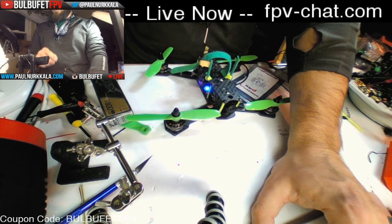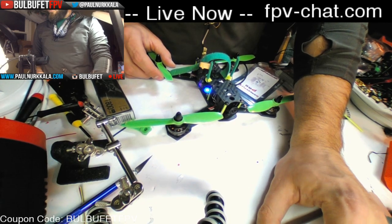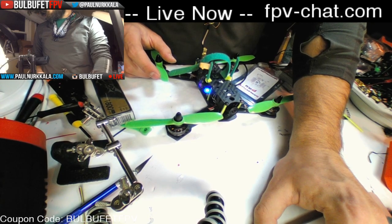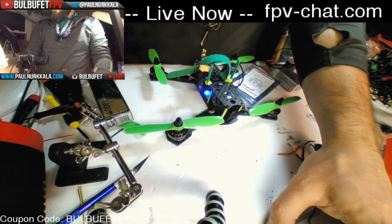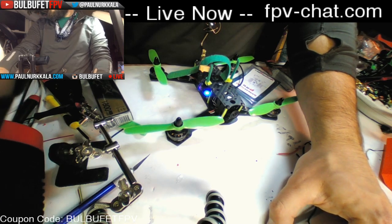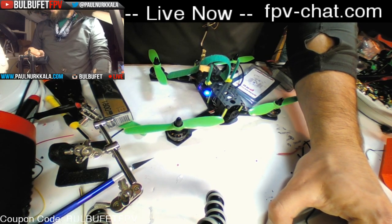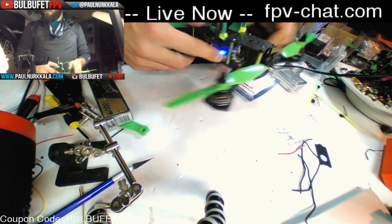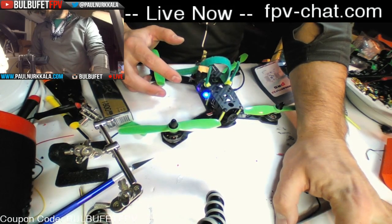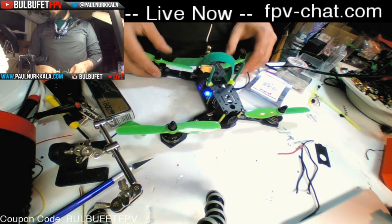I'm going to turn the accelerometer back on. It should be 270, not 90. Yeah, I'm turning on the accelerometer. Hold on. I don't want to just try 90. I want to know that 90 is the right way. Okay. So, calibrate accelerometer, reset Z-axis. If I tilt forward, it's going backwards. If I tilt backwards, it's going forward.